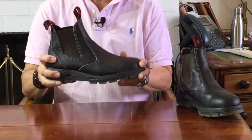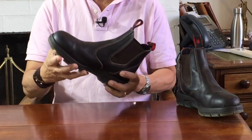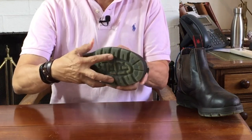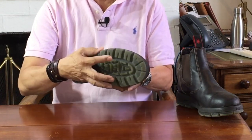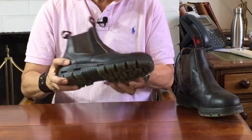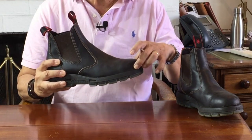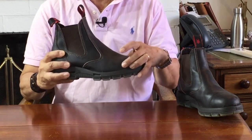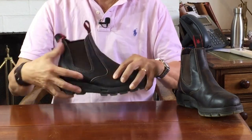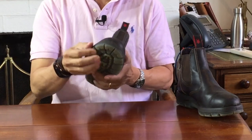This is not cemented — it's heat-moulded or thermally compressed onto the uppers. A blob of TPU is squirted into the mould, a bit like toothpaste, then the uppers are pressed up into the mould, and the whole lot is thermally heated to melt the TPU, and as it cools, it seals itself to the leather at a molecular level, where the PU is pushed into the fibres of the leather, forming a very durable connection and seal. Then the whole process is repeated to attach the PU outsole plate to the TPU midsole. Unlike a cemented sole, it's almost impossible to tear the outsole from the midsole, or the midsole from the uppers.